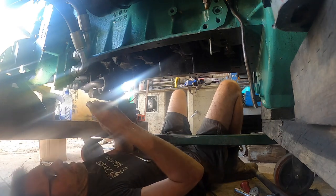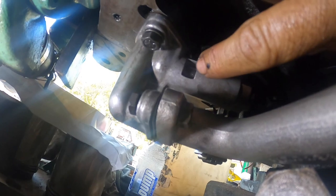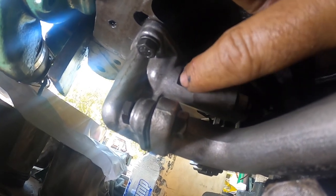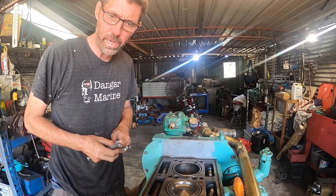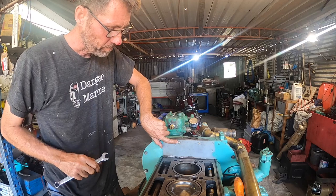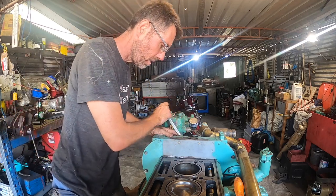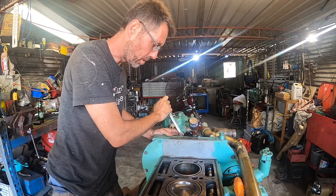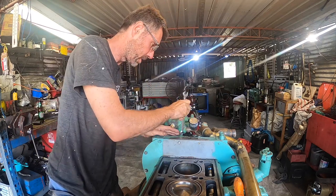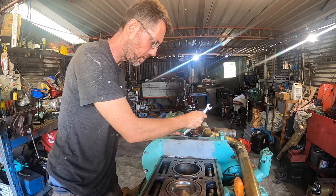All right. Half inch the block. Yep. You can see there, little vent window where it bypasses to let the pressure out. Getting ready to put the head back on soon, so just backing these two bolts out. These sit inside pockets in the head, so they're all right to tighten up once it's on, but you can't get them past it, so just back them off until it's flush.